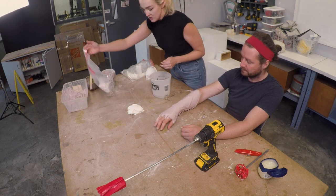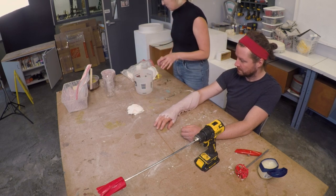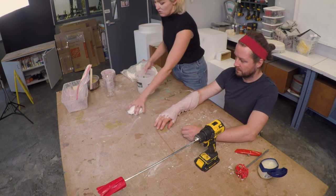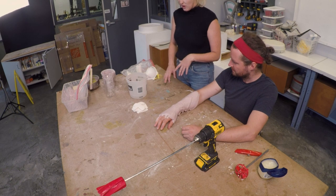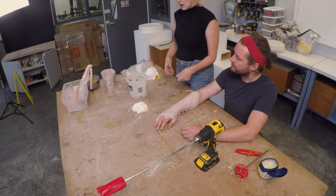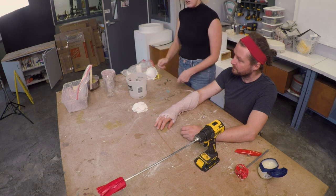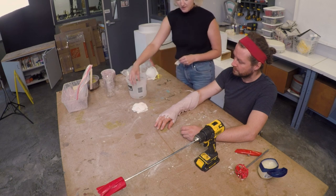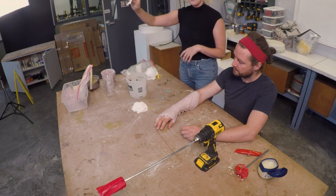So right now, we're just going to apply some plaster strip pieces to what we have here. I have some that are pre-cut and stacked. I will cut various shapes and sizes. These are a little bit small, but they'll work for what we're doing today. I will roll out plaster bandage on top of one another to where I have three sheets high, and I will cut pieces in stacks of three, and I will position them so that every single time I'm picking up a piece of plaster bandage, I'm actually picking up three pieces of plaster bandage.